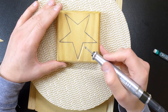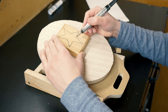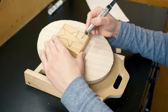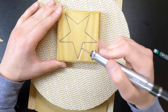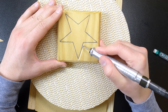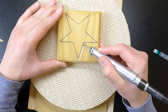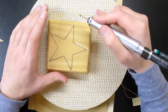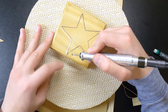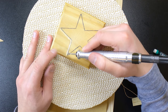While you're doing this, you always want to keep it going in one direction. Don't try to go back and forth because you're going to get a lot of divots in your wood. When you get ready to smooth it out, kind of go in reverse very lightly — don't try to dig in, let the burr do the work for you. I just made a mistake and went too far over, but that's all right because I have some real estate to work with.